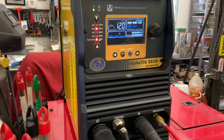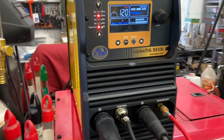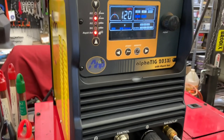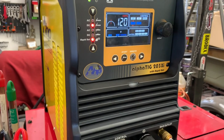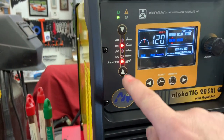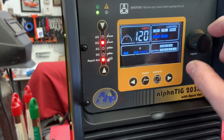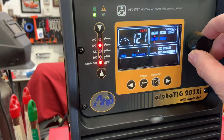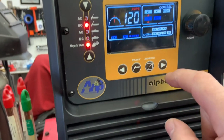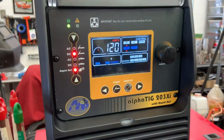I have to excuse the fan noise, but it's really not that bad — about half of what I'm used to, but it's not on demand, it's on all the time. I goofed around both on AC and DC using just the rapid set, which you select with these menu arrows, and you can always alter their suggestions. High-frequency, 2T, 3/32nds tungsten — that's just a mild steel test I just did.